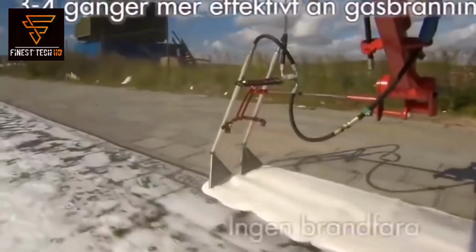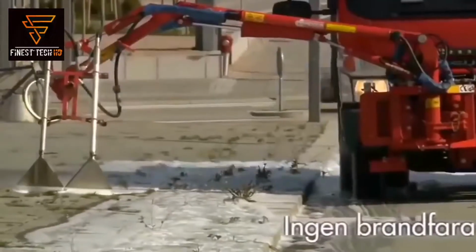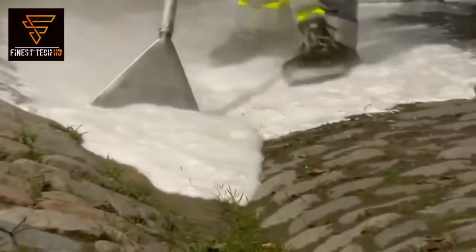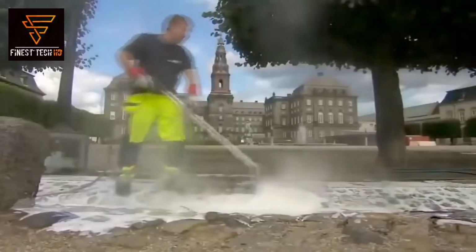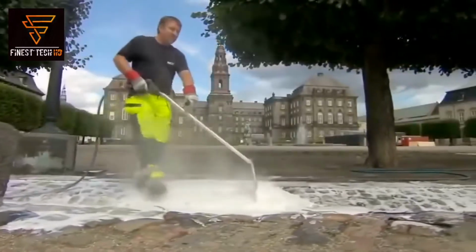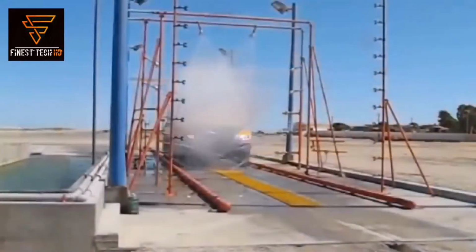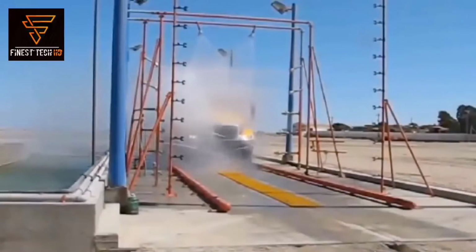A pressure washing surface cleaner is a tool consisting of 2 to 4 high-pressure jets on a rotating bar that swivels when water is flowing. This action creates a uniform cleaning pattern that can clean flat surfaces at a rapid rate. Hydrojet cleaning is a more powerful form of power washing, employed to remove buildup and debris in tanks and lines.